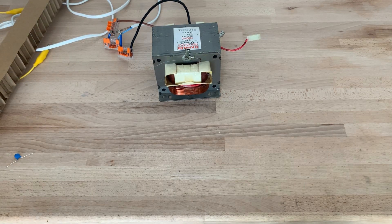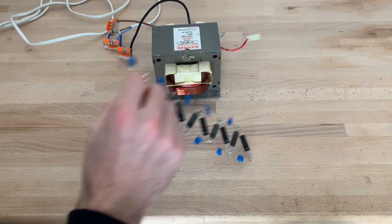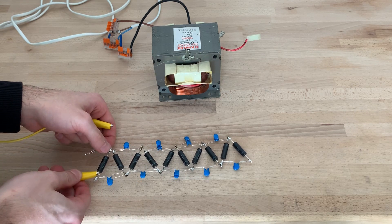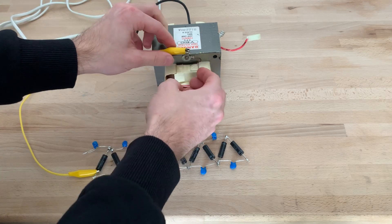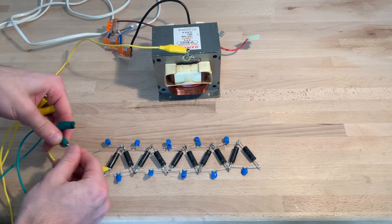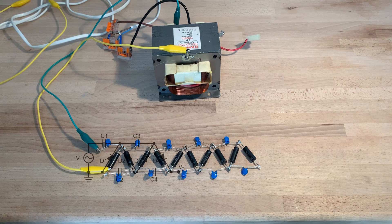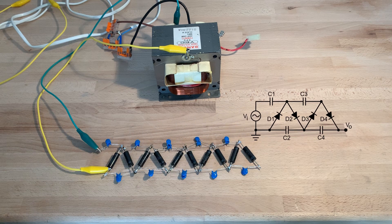Now there's a simple circuit that can increase every AC voltage — it's called a voltage multiplier. It takes multiple phases to charge up and the current is limited by the capacitors used, yet its output can be impressive. The schematic shown is a four-stage multiplier, but these can be increased as needed. The output voltage is equal to the input voltage times the number of stages.